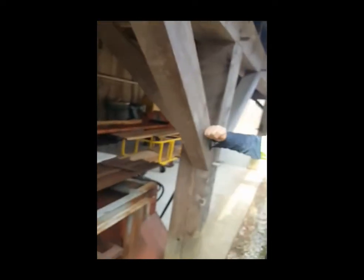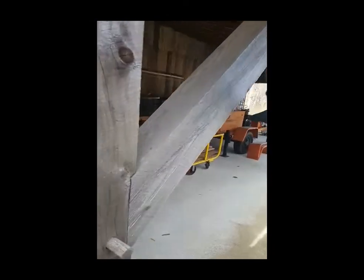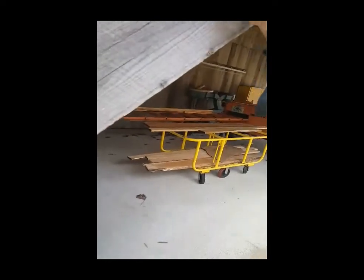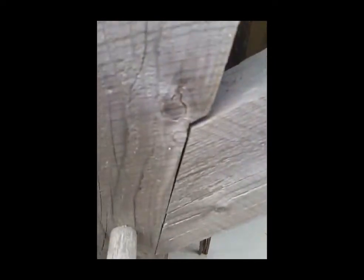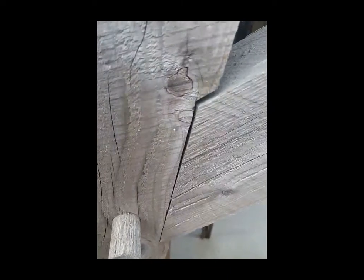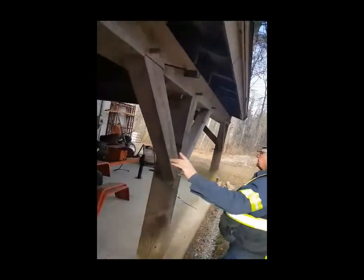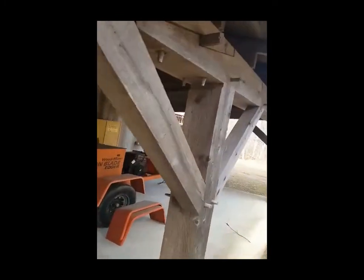The plates were 8x10 and the posts are 8x8. One sounds a little different, but it's not loose. That one's a little bit open right there, but this side is tightened right up. 1-inch oak pegs. And as mentioned, 56 feet long. This one's a little open, but that's because it's on a bladed scarf.